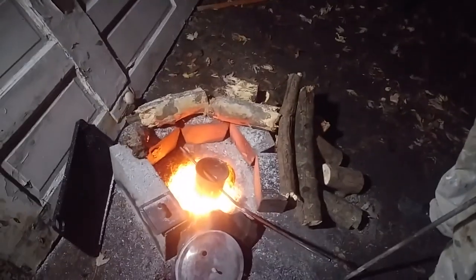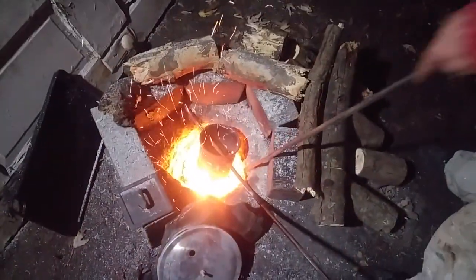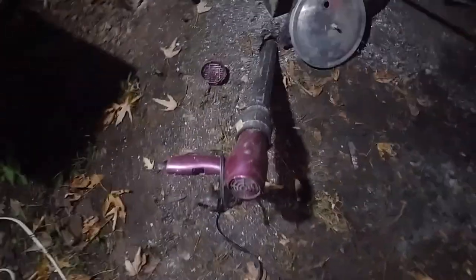All right, remember, we're making our ball mill. We've gotten pretty good on that. We've got the motor pressed and stuff, and we've been milling our own medium because we can't really afford to buy it. So we've done aluminum and lead. This is lead there now. We're about to pull it out. That's just a hole in the ground with a blow dryer shoved into it.